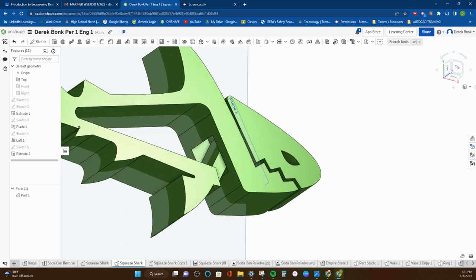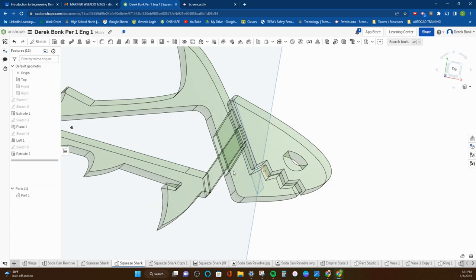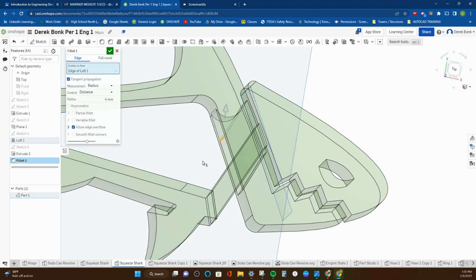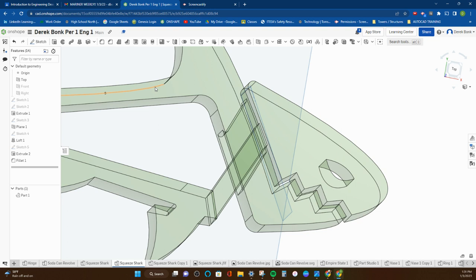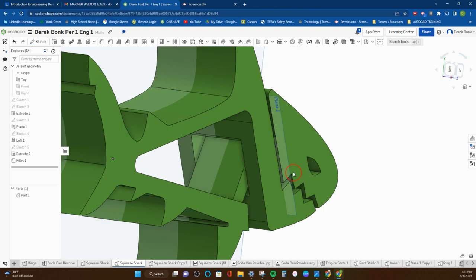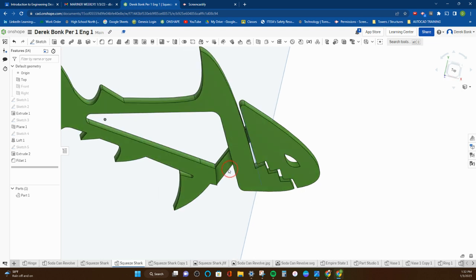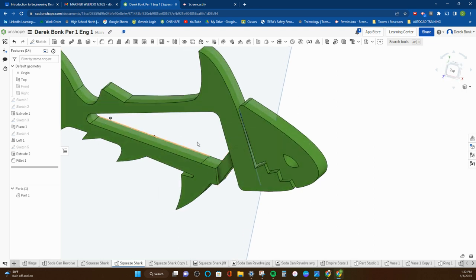And if you wanted to even refine it further, you can look at this thing and translucent. And like if you were to print this multiple times, you might see that this, as it moves, doesn't really clear things properly here. So you can round over edges with things like fillets, and even up there to change how things fit. And that can be modified further. And same thing in here, I can put in rounds. I can round out the outside edges of things like this, and it'll all print nicely.